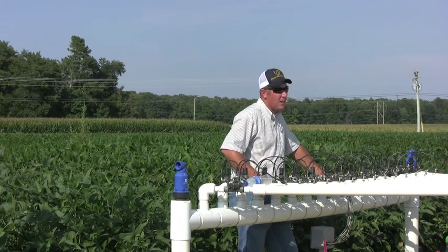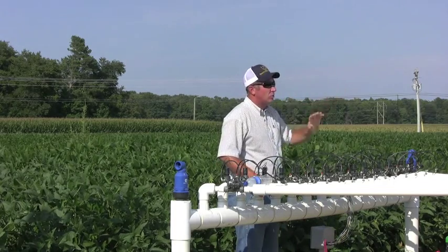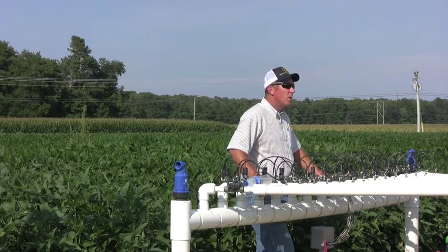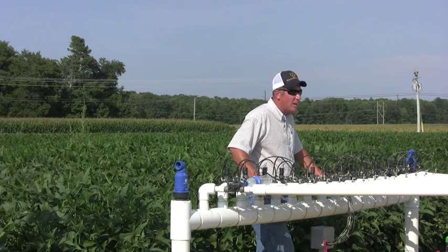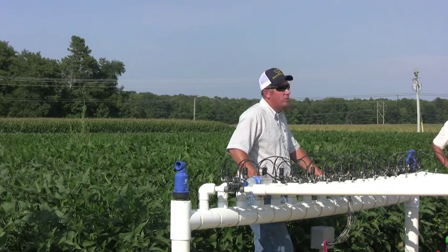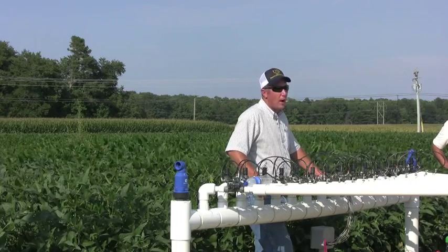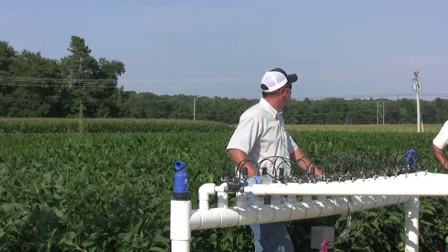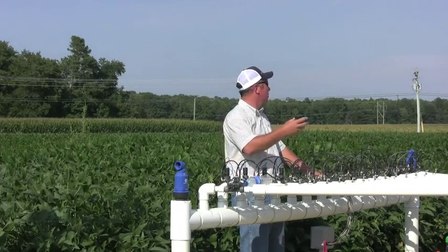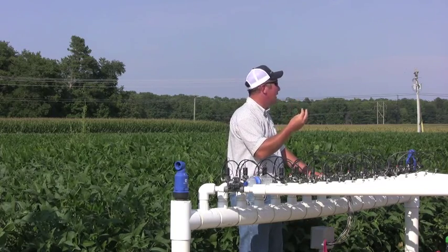I like to mess stuff up at the beginning of the season. We were using the same treatments to trigger irrigation based on soil moisture sensors. Started getting to our triggers at about 30 centibars and 40 centibars and started turning water on. We ran three to four tenths of an inch of water every day and could not get it wet — it was continuing to dry out. What that told us right off: we started four days too late. This system will maintain moisture in your profile; it will not replace it. So once you've got the water there, it'll keep it there, but you can't let it go. My corn was continuing to suffer from heat and drought stress, starting to curl. Did that for two days and I got an inch and a tenth of rain that bailed me out.